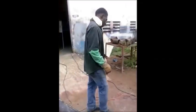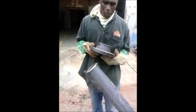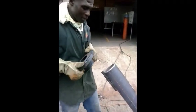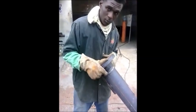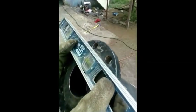Now we go to the drying part of our fitting, where we're going to line up our pipes using the two-hole method. This is the two-hole method where we use the level to line up two holes on the pipe. When it's leveled, we ask the welder to come in and tack. So that's where it's leveled.